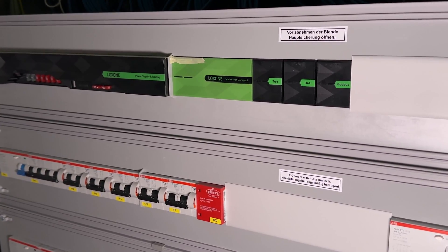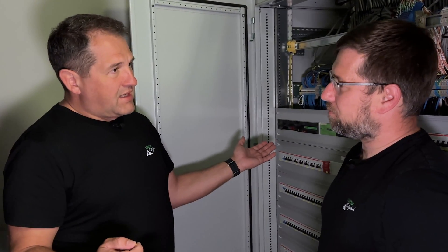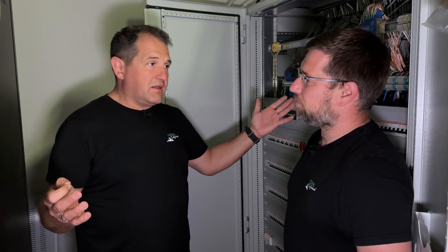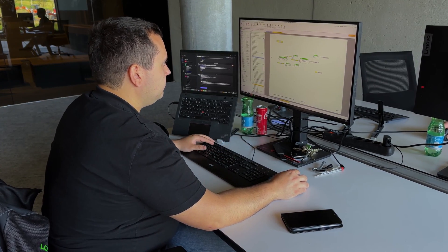We just put it into operation now. As you can see the mini server is still blinking — it's in the middle of the construction site and is in charge of the vending machines downstairs. In the client gateway, once you have decided what to call the rooms, please specify the rooms at the time the plans are drawn and not during commissioning on the construction site — this will make your life simpler. Make sure they are all written down correctly in the documentation, as in 10 years' time you won't be able to find anything otherwise. So we have digitally named the rooms and each of the environments. And if we later conclude that a client gateway for the common areas would be good, everything is connected and functioning in a common maintainable configuration and interface for our colleagues in the caretaker's office.